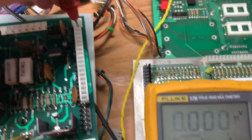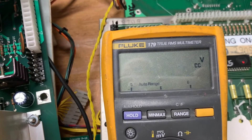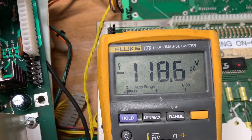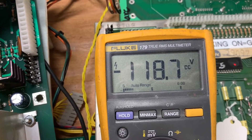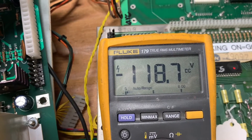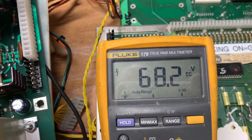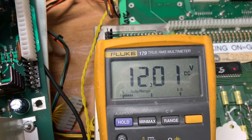There's 96 volts — that's normally about minus 100 — and minus 118. Now, why aren't those 12 volts apart like they're supposed to be? It's because the power supply is not loaded at this time. They will be 12 volts apart with a DMD attached to it.